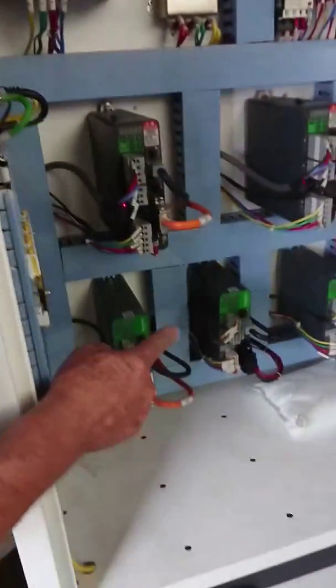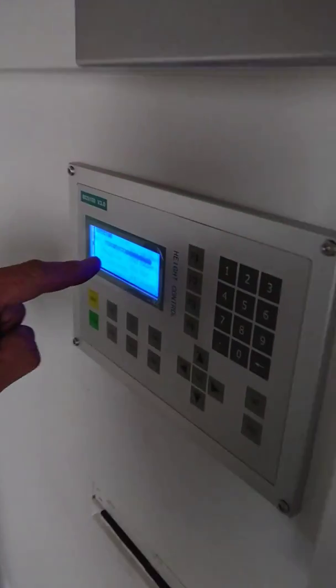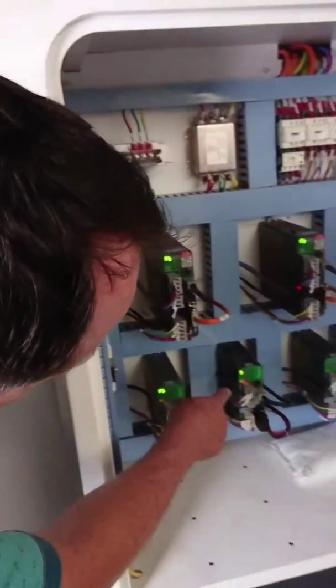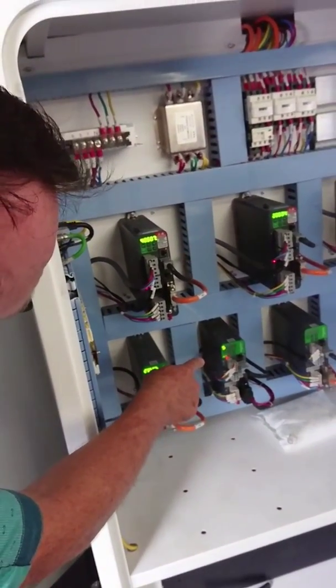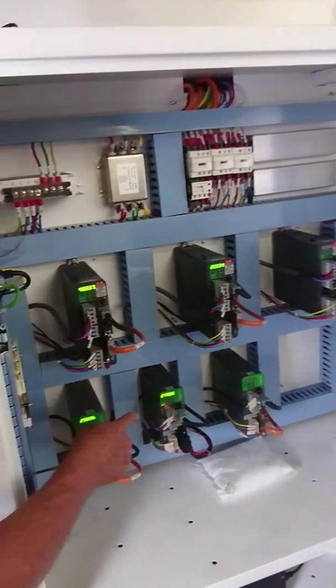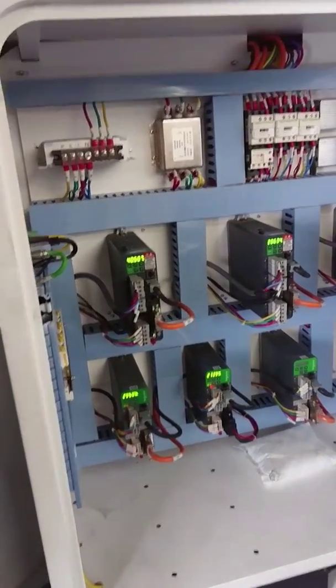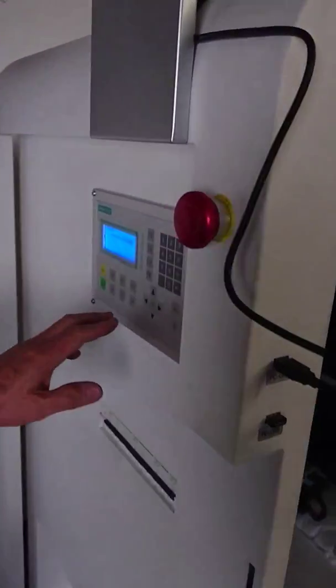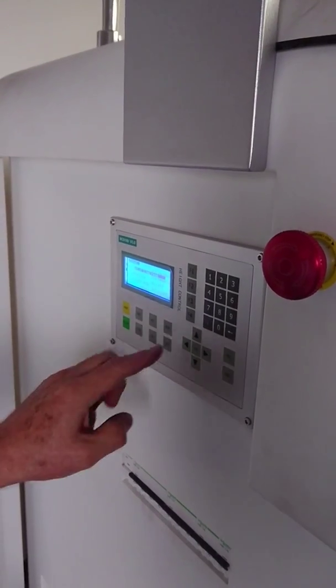After the BCS has booted up, I then will turn on the amplifiers. Right now I'm turning it on. If you look at the alarm here, you'll see 'out of Z negative range servo alarm.' You'll see that it's booting up, and it will show position. And there we go — it moves slightly, and then it falls into position. It still says 'out of Z negative range.'